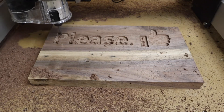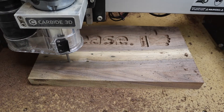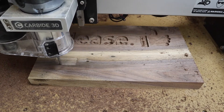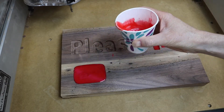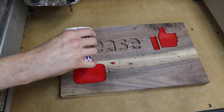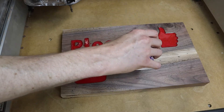I need to carve this in two portions. The center of the YouTube button needs to be white, embedded within red. So I have to carve and pour that part first, so I can then carve a white triangle out of the red resin. You'll see in a moment what I mean. I wasn't sure how well the resin would carve, but it went really well. I guess if the machine and bit can handle hickory, it can handle resin too.